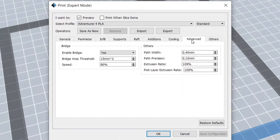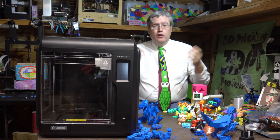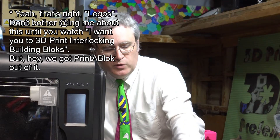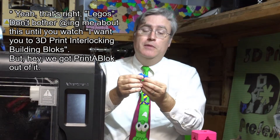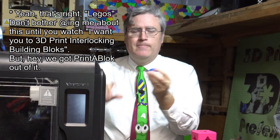The problem I found was that in the slicer the default is to print at a 104% extrusion rate. Yeah, that's a little bit too much. Crank that back down to 100 — actually I found 98 works pretty good. Once you fix that in the software, all of a sudden things start working. Another test print I do is 3D printing Legos to see how they stick together, but those were running into that over-extrusion problem too. Once I fixed it they actually worked with each other. Kind of. Mostly.